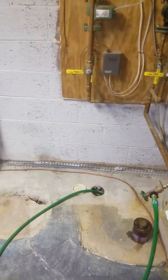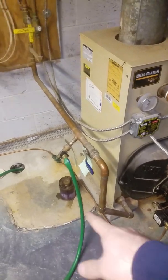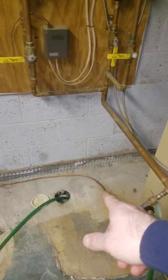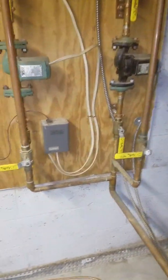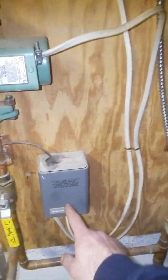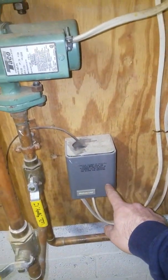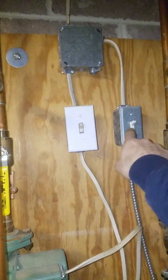Also, the oil line is not buried in the ground, which is another important thing — you never want your oil line buried in the ground. Right here we have the main aqua stat, which controls the circulator pumps. We also have a disconnect set up right here.